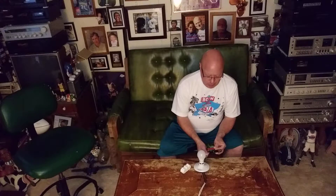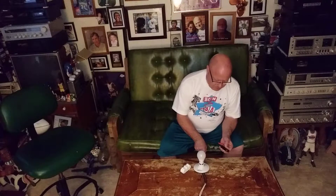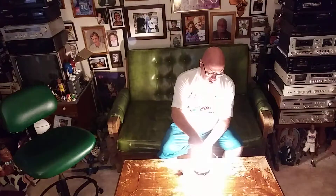You can see that little glow inside that bulb — that little neon light is just starting to glow a little bit. That means that side is live. So if I were to touch this part of the socket and something grounded, I would get a shock, but the light would still work when you screw it in.